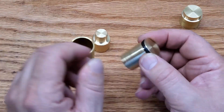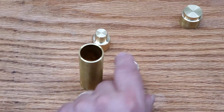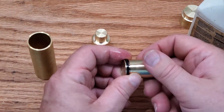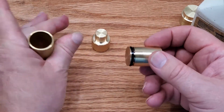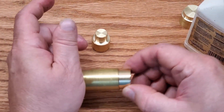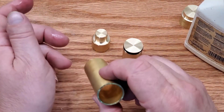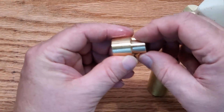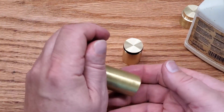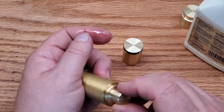It does give me one more wear-and-tear part though. The solid brass piston with some thicker lubricant eliminates the wear-and-tear part, but that thicker lubricant could end up causing issues with the valve. I have no idea which way I'm going to go just yet, but that's not a decision I need to make right now. You can see it moves quite nicely, and it still has a bit of room to be turned down to be a little more loose. I suspect the o-ring will give less of a problem with gas escaping - this one might be a bit more of an issue that way. So there are pros and cons for both.